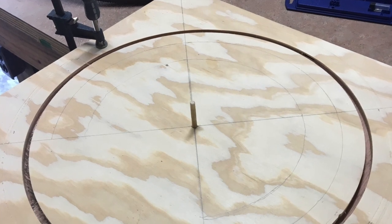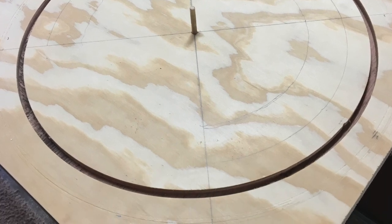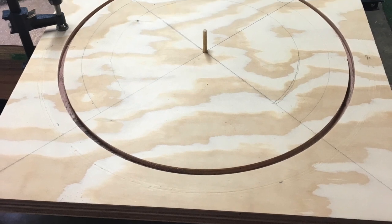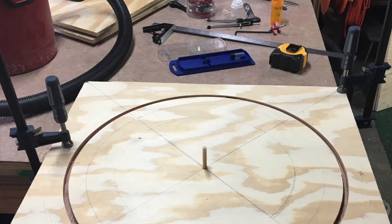Now as you can see from the layout lines I am going with a Thein baffle. It is 22 inches in diameter and it will sit inside the lip of a 55 gallon drum that I plan on using as my collection bin.